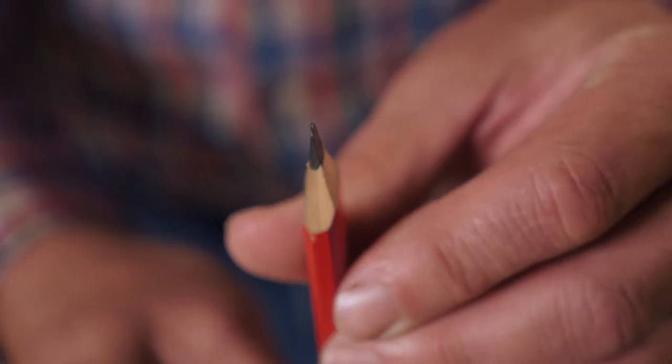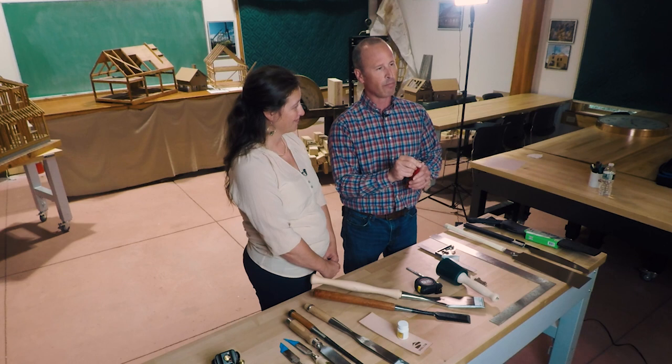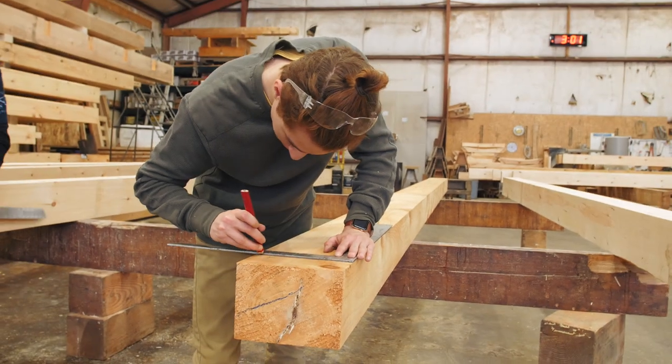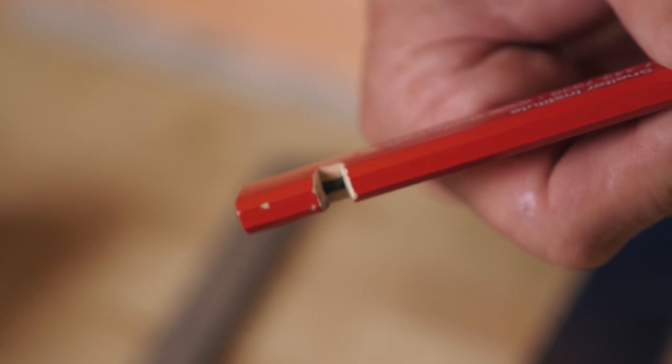This is a carpenter's pencil. The difference between a carpenter's pencil and a regular pencil is that the carpenter's pencil doesn't roll when you set it down, and also the graphite beam is much more robust than a circular piece of graphite in a round pencil, which allows you to mark on rough wood without snapping off the tip. The trouble with the carpenter's pencil is that it's made to do many different things so the graphite is quite blunt, so you want to spend time with a utility knife or your marking knife to pare down the tip so that it's very fine. The accuracy of your joinery will only be as good as the precision of your layout lines. There's also a detail at the rear end of the pencil that exposes the graphite, allowing you to mark up a straight edge and rub it on the surface of your tenon — the graphite rubs off on the high spots of the tenon so you know where to pare to get a good flat surface.